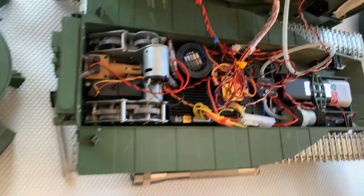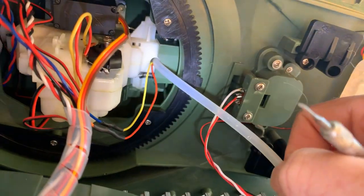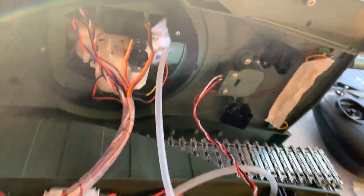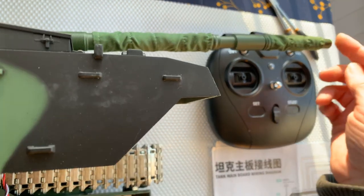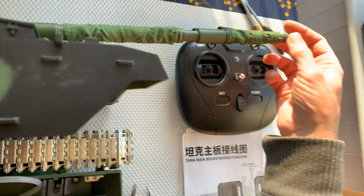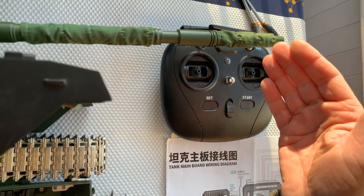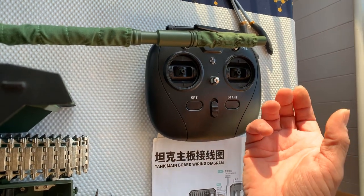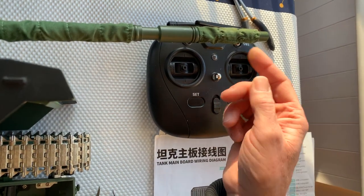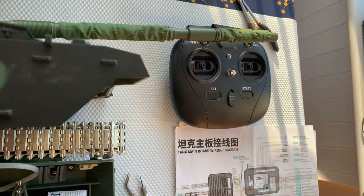You can see it here as it's in situ. Now, the end of the gun barrel — you don't have to go all the way to the end as long as the LED is close towards the front of the tube. Because the smoke has to get past the LED but you don't want to mask the LED with the tube. So put the LED in front of the tube — it only has to be just in front but the smoke will get past it.